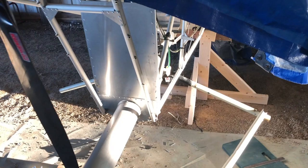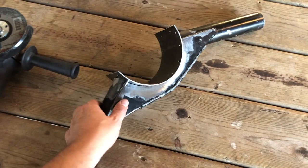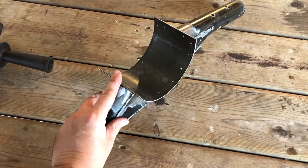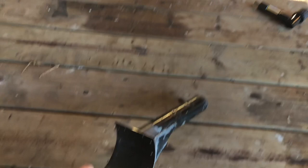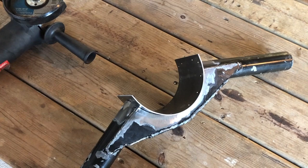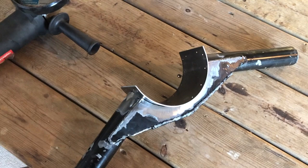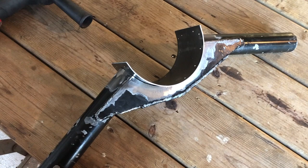It doesn't have to be really perfect, although I'd like it to be. So we're going to go ahead and pull that saddle off and grind the rear tack weld off, and try to adjust the relative angle of the gear leg tubes to the curved saddle plate to get into a little better alignment. Here's a better look at the main gear saddle for the CGS Hawk — this is the new piece we fabricated and rolled. We took a paper rubbing of the holes in the boom tube after cleaning off all the epoxy, and that's where we got this hole pattern. I'm pleased it's somewhat close — not perfect, because rolling the plate did shrink it a little bit. I'll be using some longer rivets, quarter-inch grip, to get more displaced rivet head inside the tube, and I'm going to go up from three-sixteenths to quarter-inch as well, hoping I don't snowman too many of the holes.